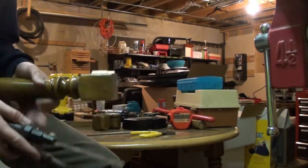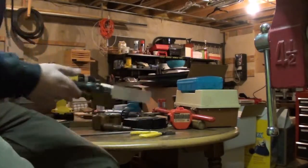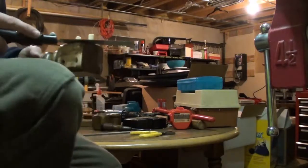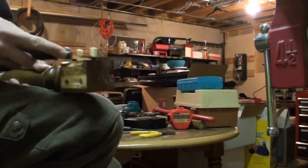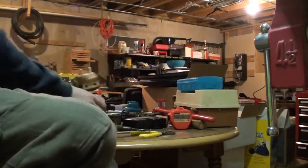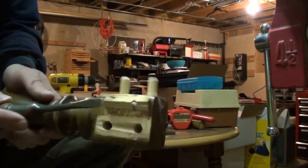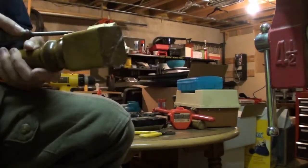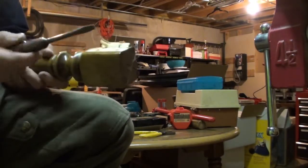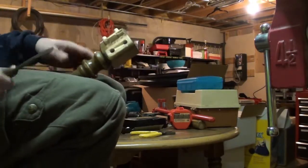So a couple tips for reusing some furniture. Say you really like this piece up top here and you wanted to use that. What I did before is I used a flush Japanese-style trim saw. You can just catch it right, and they come off in a couple of cuts, so it doesn't take long. And for pieces that get stapled together and break off not so clean, you can take a flathead and a hammer or mallet and work it out, pop them off, and then these staples are pretty easy to get out.